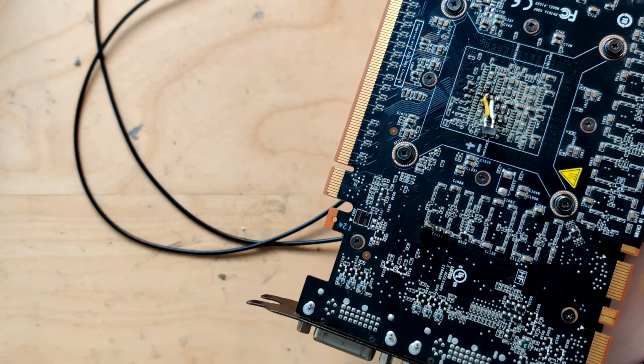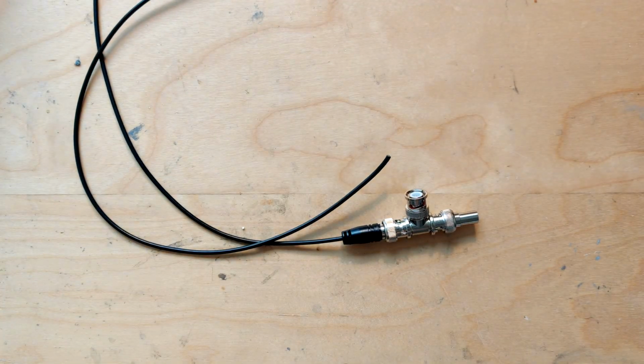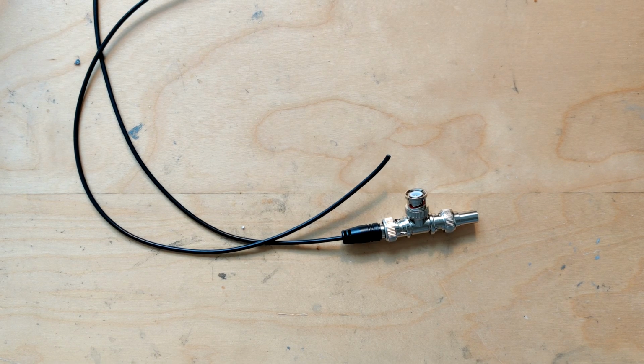measurements. I had huge issues with the included probes, where the oscilloscope was reading very, very high on voltage. With my multimeter and my EVC, I would read something like 1.2 volts at the VRM output, and then the oscilloscope would claim that I'm running 1.25 volts directly behind the core, which is not how power planes work.